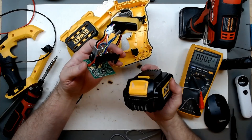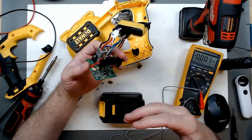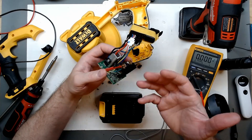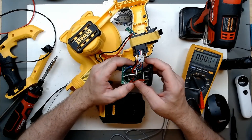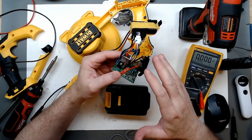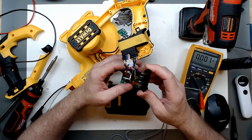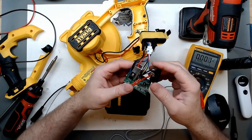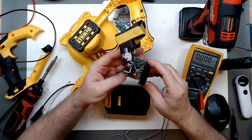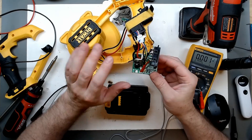The drawback — and the reason this wouldn't be recommended for everyone — is you really have to monitor your pack yourself, or at least recognize when the tone changes and it starts getting really weak, which tells you the battery is past due to be pulled out and charged. Don't let the battery get pulled down too low. This board also monitors battery temperature, so be mindful of that. I've already looked at this off-camera for about an hour, so it's time to cut ties with deep diagnosis.